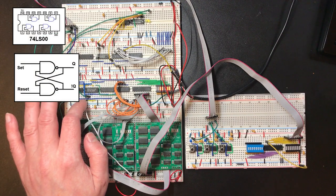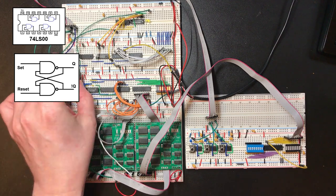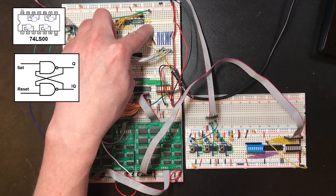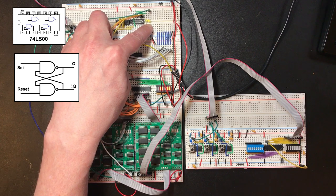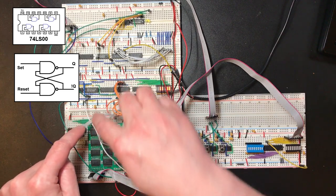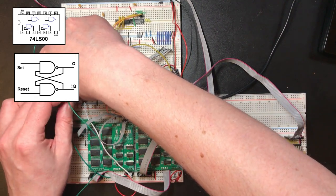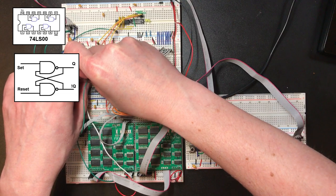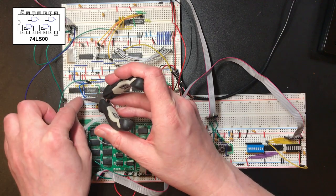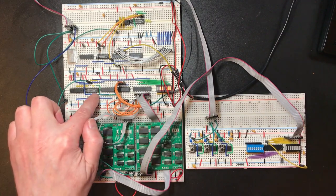So it's write when a byte's received, triggers this to take a byte in and increment the total. So this is the status bit output from the set reset latch. So this LED is just saying there's a byte available, and that was previously going off to the status register. We don't need that anymore because we've got the full count coming over here. So actually, this output line is actually that information. So I can pull the rest of the wires for this SR latch out. It's possible these spare gates will come in handy.